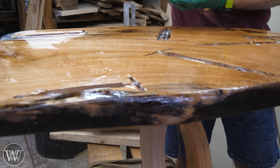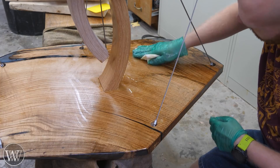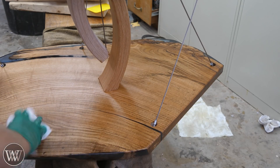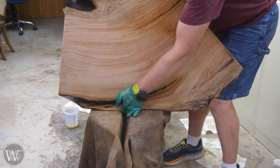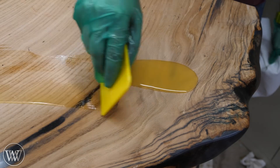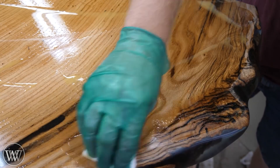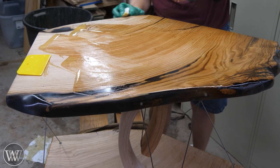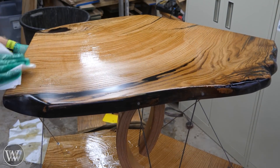You put it on just as thick as you see here — basically a thick gel coat — let it sit for about 15 minutes, and the wood will soak up as much as it possibly can. Then you come back and wipe it off: one rag to wipe off the majority, then come back and wipe off all the rest, bring another rag in and polish it down, and that's it. You let it sit for a few hours to cure and the finish is done — it's a gorgeous matte finish. The nice thing is if you ever have any problems in the future, you can sand out a spot and bring in the Rubio Monocoat — it will feather into its existence. Multiple layers don't make it darker, it just soaks in, so you can put layer after layer and it will look just like one coat.